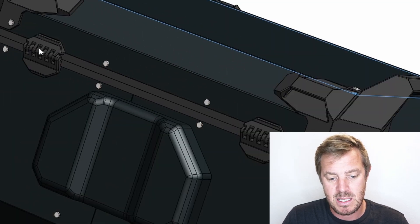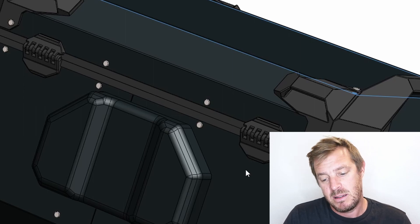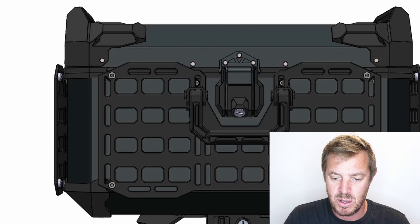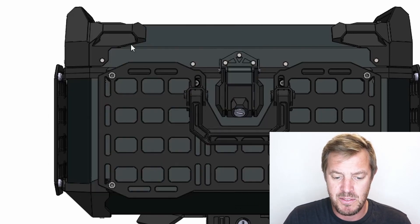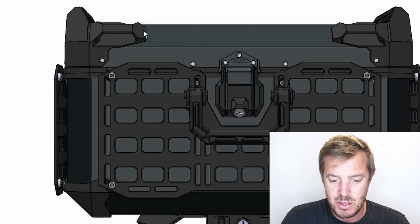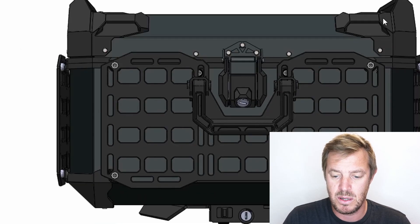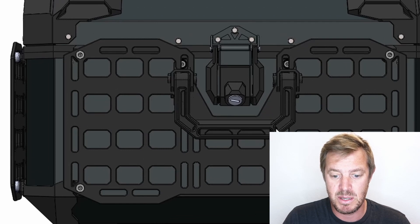We'll have to reinforce the back plate as well. Testing has shown that if this hinge is a little bent from usage, or too much stuff inside has pushed things out of alignment, the whole thing becomes leaky. We're going to reinforce that whole area and probably bring the two handles down so they're flush — so you can put an overlander bag there. There are also some fixing points at the top, maybe with rivets, so you can attach or tie down something. There's also a handle at the front.